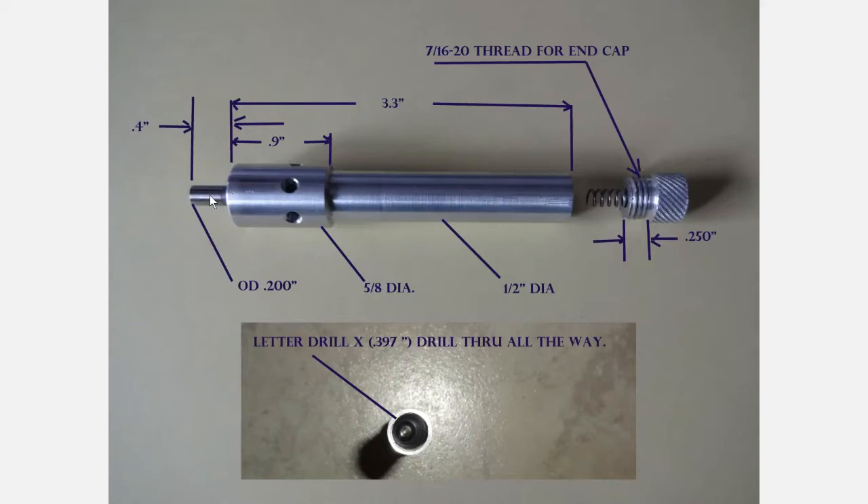There are also these holes — they're 1/8-inch holes spaced every 60 degrees all the way around the diameter. We need to know laterally where to put those holes. If you put your battery and your electronic module in here and put your cap on, then down at the other end slide a rod in, you can find the measurement from the end to where that module is. The holes should be somewhere fairly close to where the LED is at the end of that electronic module — that's how you determine where to put them.